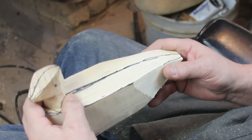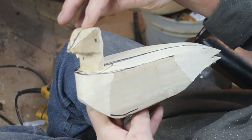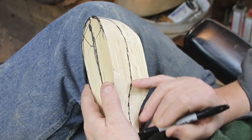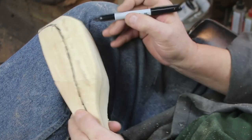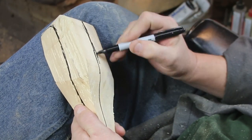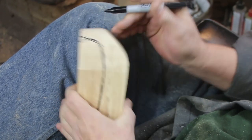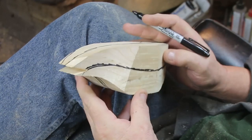You see I went and cut the profile there. I don't sandwich it back into the scrap pieces or any of that. I might take a scrap piece and stick it under the edge of it so that it has some leverage. So once again I'm drawing the center lines in, and this guy — the whole intent of this one — is it will not have detailed feather carving. We won't be doing six burning passes or a couple of stone passes on this.